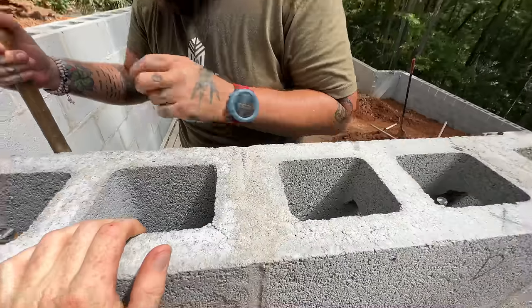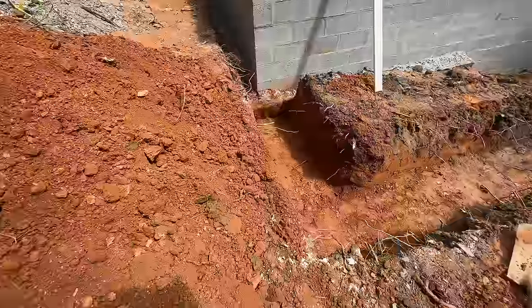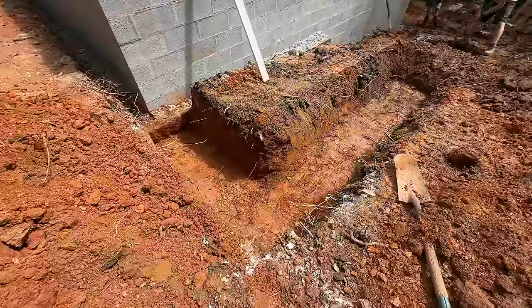That's looking good. Why are you sweating? Because we're having to fill in the moat around these footers — we're rationing all the dirt. We don't have enough dirt. So we've got all of our footings dug and we're prepping for the concrete pour. We're going to pour the wall, and between now and then we need to get grids of steel in here and all the verticals in the wall. We're waiting on a rebar cutter from Beaver Hydraulic — it's hydraulic and it cuts the rebar fast and easy.